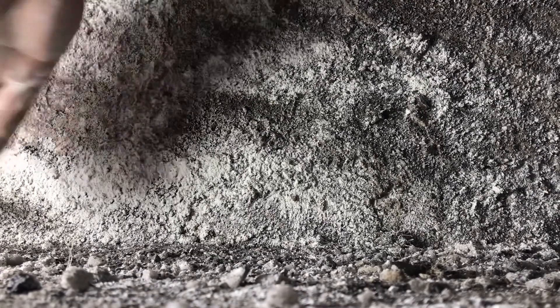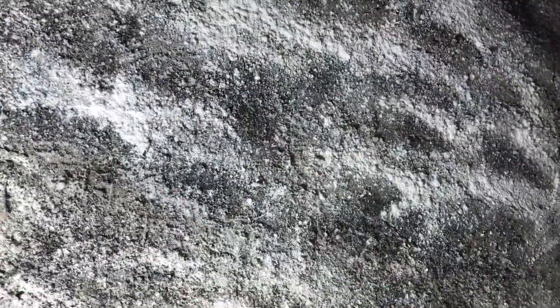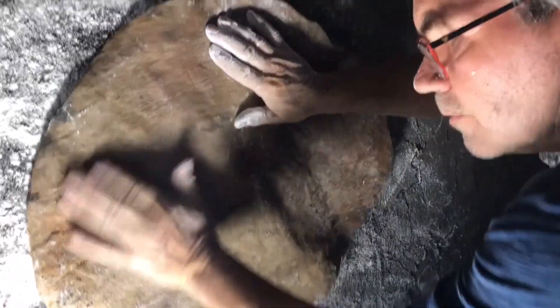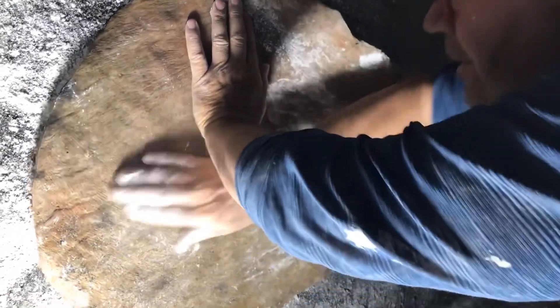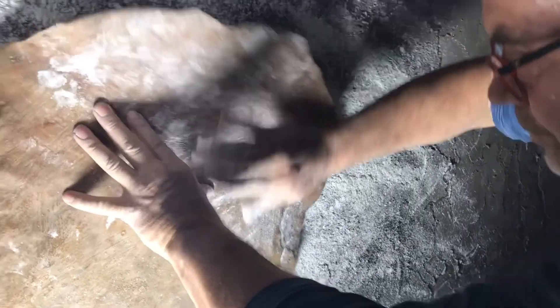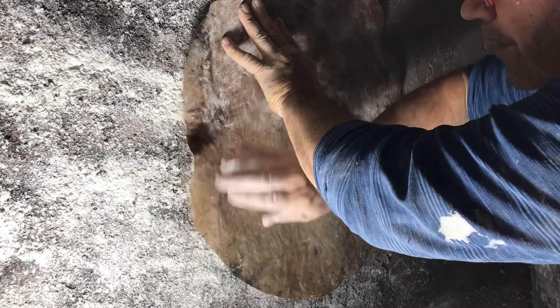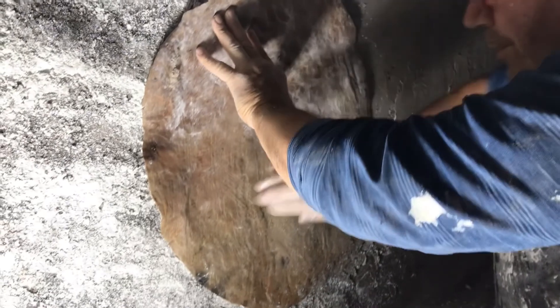There's a lot of white here so I'm going to add a bit more sand. I cover my skins with white cement as a release agent. It's very thin, so there's not a lot to stamp, but what I like about this is it actually pushes the color into the wall a lot more, so you get a better result. Use bigger skins — don't use small skins because they leave edges. This bigger skin will not leave any edges whatsoever. It's like pushing in the material without it coming off the wall, much better than using a trowel.